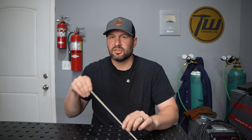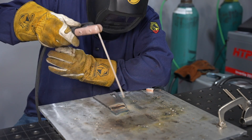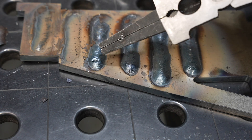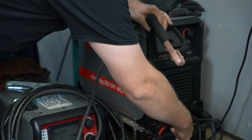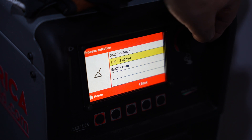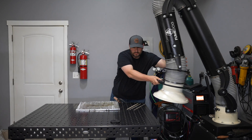Welcome to the shop. Today we're talking about how to restart a 7018 electrode where you've used part of it up. This can have a couple of challenges: one, it might not start — you just strike and strike and strike and don't get anything. The second is you end up with porosity at the start of your weld on the restart of the rod. I'm going to talk about how to address both of those issues. I love 7018 — not only is it great in industrial applications for its high strength and low hydrogen weld deposit, but even on hobby work it's easier to read the puddle and you get a really beautiful bead.